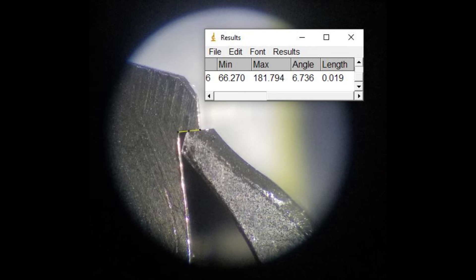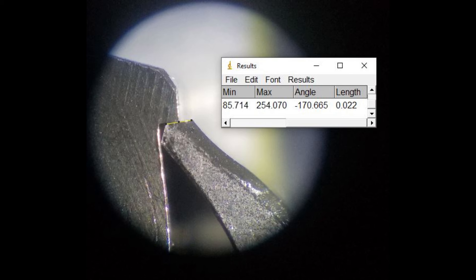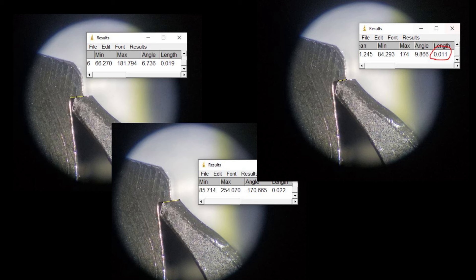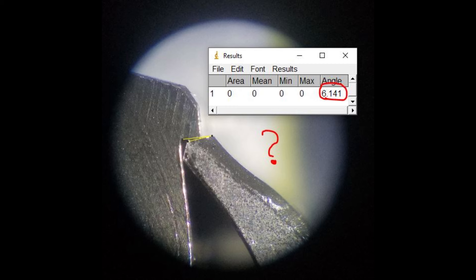Here I will confirm my 18 to 20 thousandths tall hammer hooks, a 20 to 25 thousandths wide primary sear face, and about 10 to 15 thousandths of hammer hook engagement. If any measurements aren't where I want them, I take the hammer and sear out and adjust as necessary. These measurements all vary with my desired trigger weight, action, and application of the pistol, but are almost always within those ranges. I can get the angle close enough to parallel that I don't bother measuring it in the software, as it's pretty hard to measure small angles accurately.